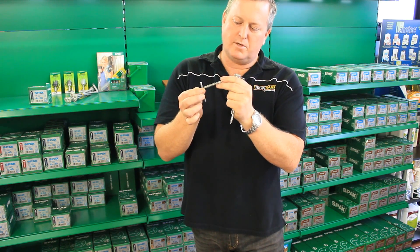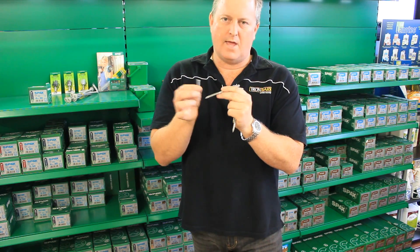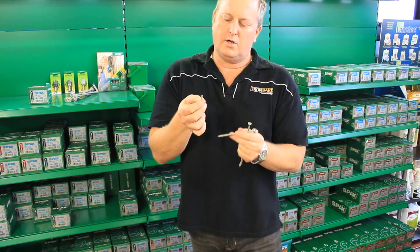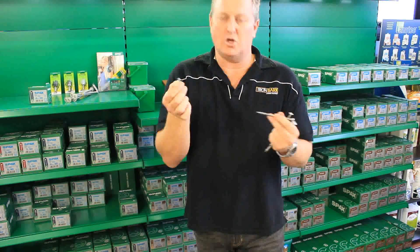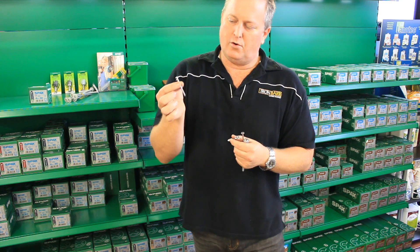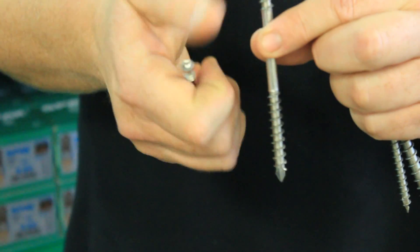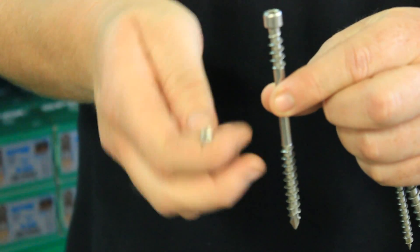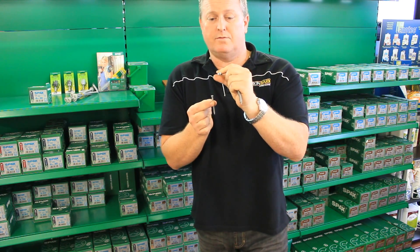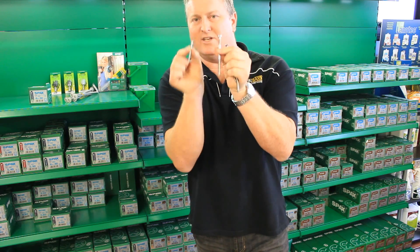You can get expansion and contraction between the joist and the deck board, and that screw will never sit high of the board, ever. Being a T25 Torx drive with the lock-in nib, you can then come along and take it back out if you have a termite observation area, or you just have a board that's playing up or faulty. If you look at councils across Australia, they have full-time crews going around boardwalks re-tightening decks. With this product, you never need to do it. The thread's there.